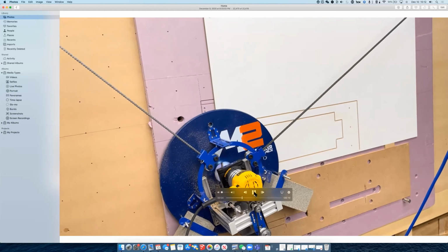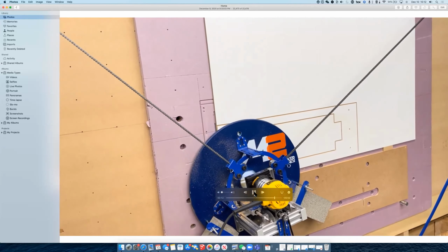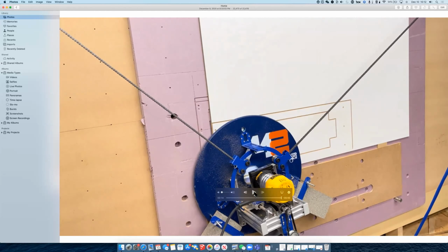And then, instead of using a bench dog, they make plastic screws for CNC applications. I can take support material like you have and drill some holes in it. It's kind of like a pattern jig almost. And then I can set it and mount it to my waste surface with those plastic screws. I have some cam locking clamps that I've made in various thicknesses, so I can lock a piece down to my waste surface. And then everything is the same thickness, so the sled will slide all around it. It uses those plastic screws and aluminum threaded inserts, so in the event that the bit were to ever kiss any of those, it's not going to create this crazy nightmare in the garage.